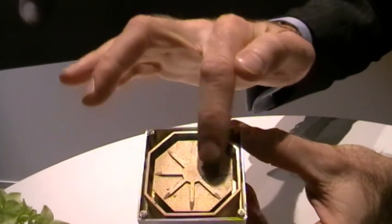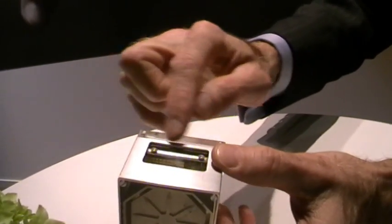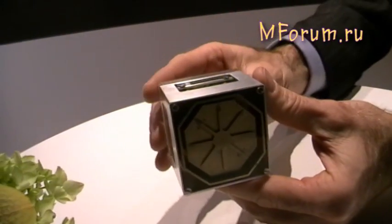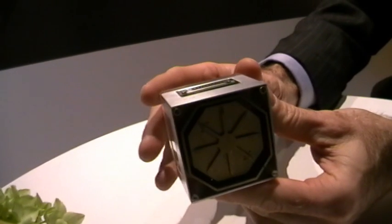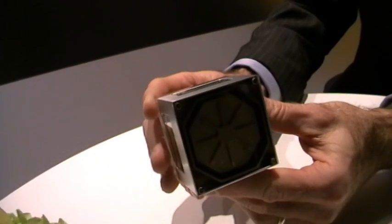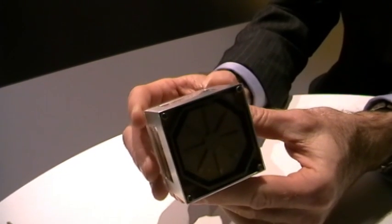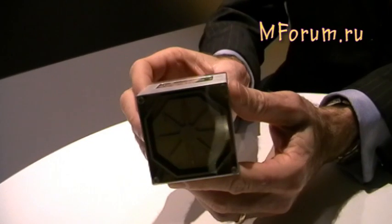This component is the passive element, which generates and receives the signals from the amplifier and from the radio. It's very flexible — I could have this as one frequency, say 2.6, and have another frequency of 2.1, perhaps another frequency of 1.8 gigahertz. This allows an operator to put three things in one box and put one thing on the building instead of three things on the building. So you're going to reclaim your urban skyline, which is very important when dealing with cities, zoning boards, and building owners concerned with too many antennas on the building. One box can represent multiple technologies or multiple frequencies on the building.